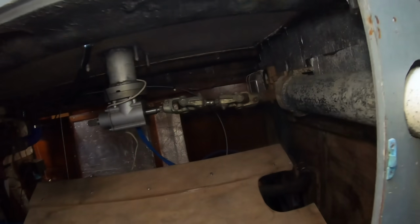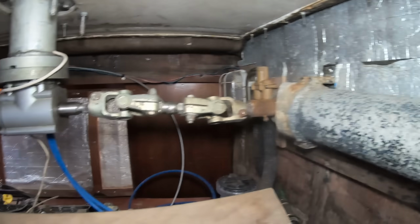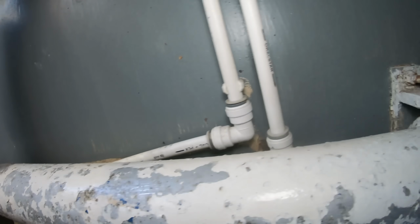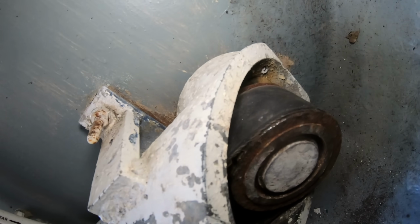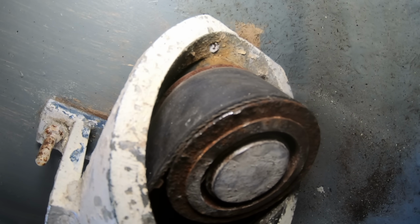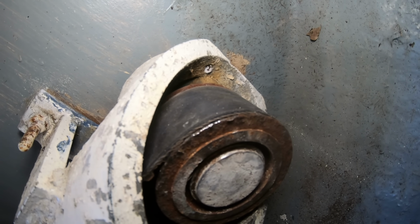You can see the steering joints are back on, that's the bottom of the post, and then it goes to a belt which runs all the way through this tube, which comes to there, a toothed belt, and then that drives straight through this bulkhead onto the bars at the back to the reduction gearbox.